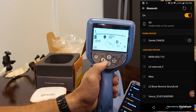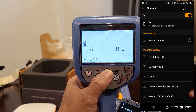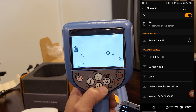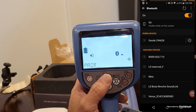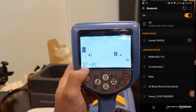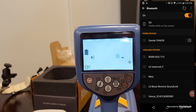On the RD8100 series, hit the on-off key quickly while the unit's on, and scroll through the menu with the up-down arrows until you get to BT for Bluetooth. Then hit the right button — which is also your antenna button — to go into the Bluetooth menu, and scroll until you see the word Pair. Hit the antenna button again to go into that. We want to pair this to a PC, not to the transmitter TX — we want BT to PC. Go into that, then hit the F key which is your back arrow, and the B will start flashing on the locator.